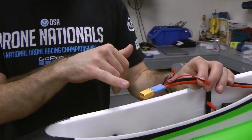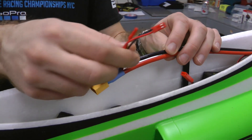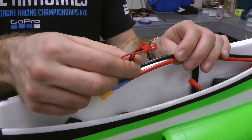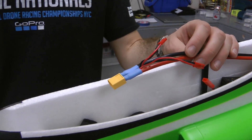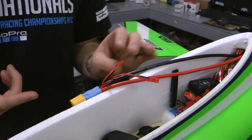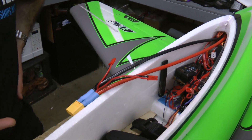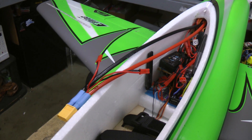Now let's take a look at the main compartment. On the main power leads I've got an XT-60, which is what we normally use, and then two JST taps giving straight 6S power — one for the lighting and one for the FPV system. I'm going for the world record on JST usage in a single aircraft — I'd guess I've got 14 JST connectors in here.